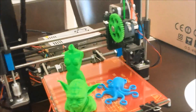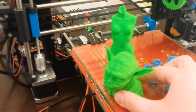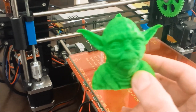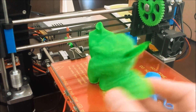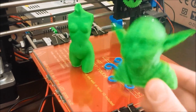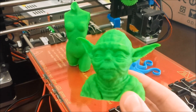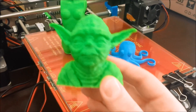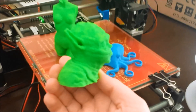I've had some success with organic shapes rather than just geometric shapes, and I'm still printing with ABS. I'm pretty sure PLA will be easier to print with, especially when it comes to organic shapes, but so far I've been very impressed. This is the Yoda head — you can download all these off Thingiverse. It was printed at about 50% scale and a resolution of 0.2 millimetres, and it's come out very well.